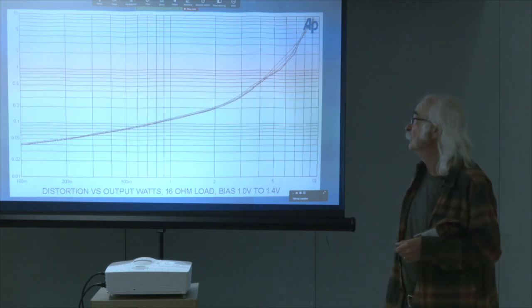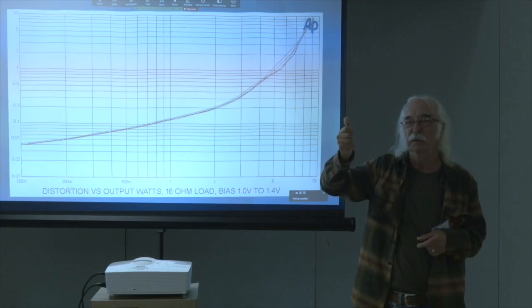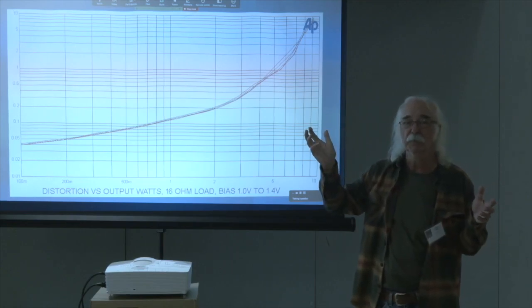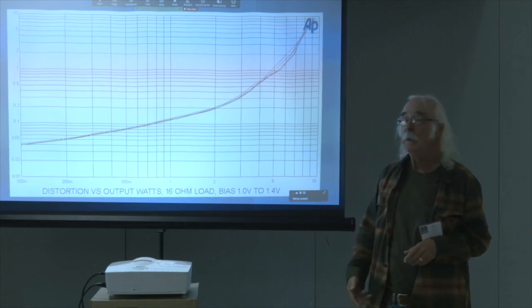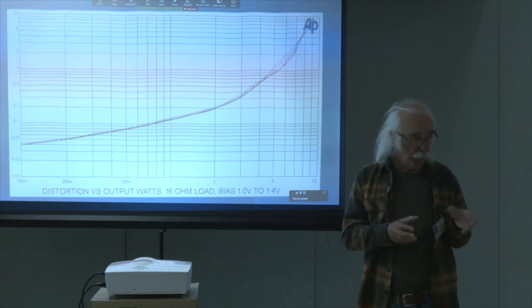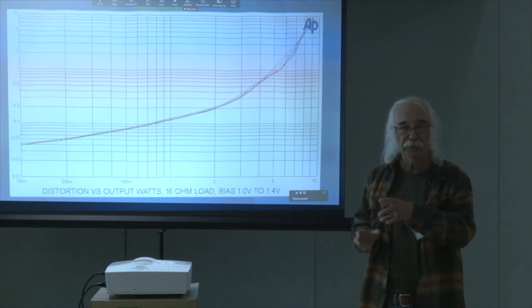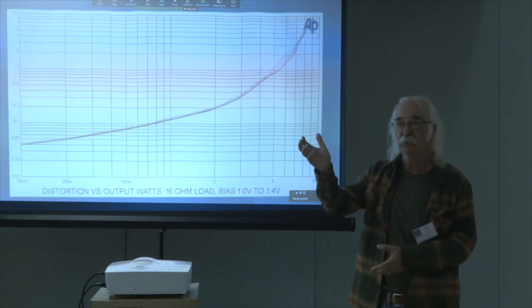That's to say, you've got plus 16 to go positive, not quite, a little bit less than that, but you're going to head positive with the signal on the output approaching 15, 16 volts. But if you let up on that, the inductor will pull it down to minus 15, 16 volts. In other words, it behaves as if there were two power supplies instead of one. Instead of one 16-volt positive, you've got the effect of a positive and a negative 16 volts.